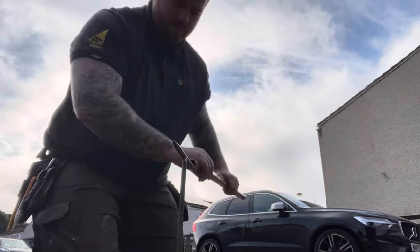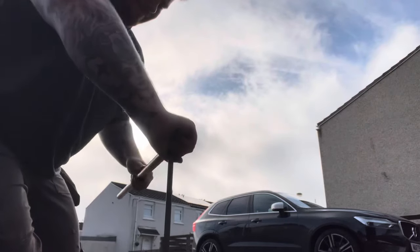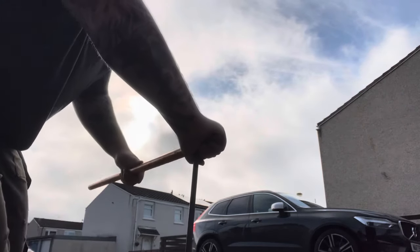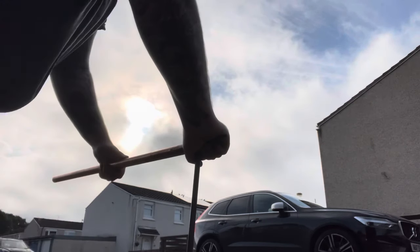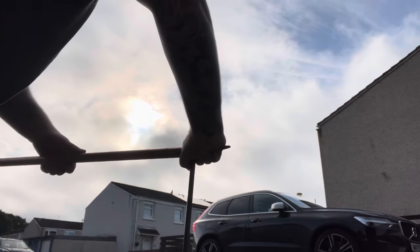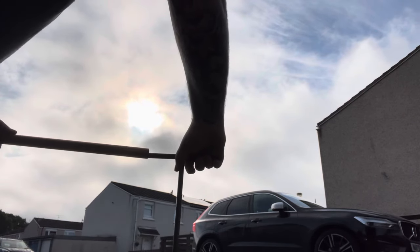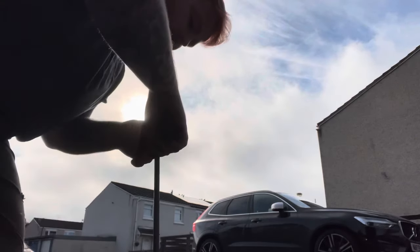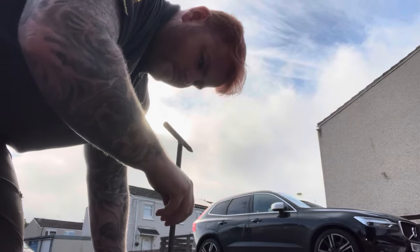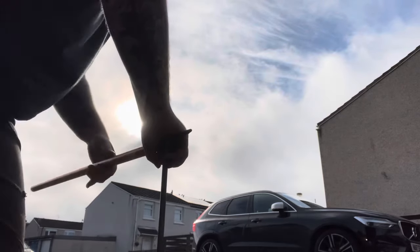It's very tight, so what I've done is I've got a bit of extended copper which gives me a bit of leverage. The thing is solid. So I've twisted it and I'm just checking back and forth with the client to find out whether or not the water's turned off. One of the most concerning things is if you're turning the water on or off and it slips off the stopcock down below — as you can see I've slipped off here and it takes a good couple of seconds, sometimes longer, to find it again.